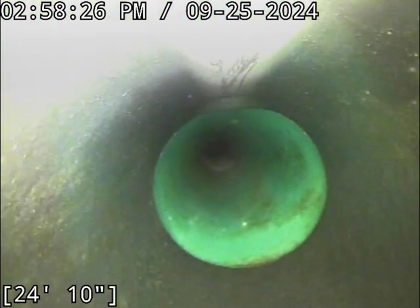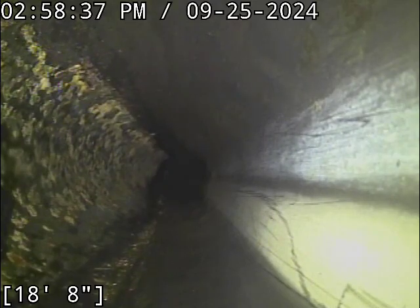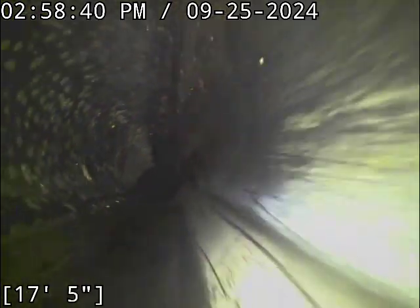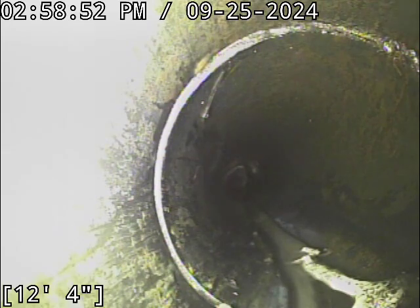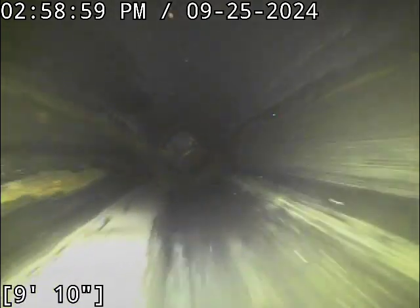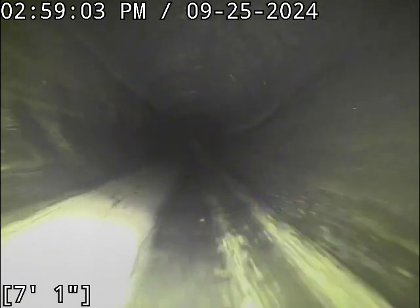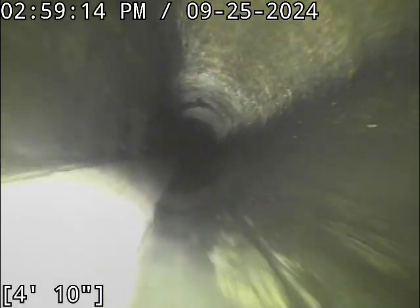About the only scenario where I could foresee that resulting in a blockage is if you're loading it up with paper towels, wipes — even flushable wipes, which are terrible; don't put them down your sewer line. They're slightly less horrible than paper towels. This line also has a lot of slope and grade to it — it dives at a very hard angle, about 45 degrees for quite a distance, so you've got a lot of gravity working in your favor. That helps keep the line moving even under a blockage scenario, which I can tell has never happened here. This line shows no evidence of being cleaned preemptively for a sale. That thin skiff of grease film in the flow line takes time to accrue; it doesn't just happen overnight.